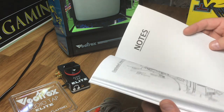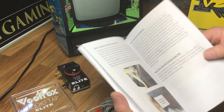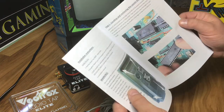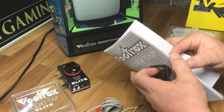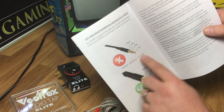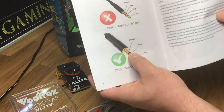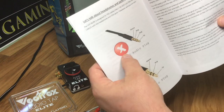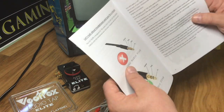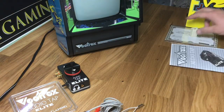This is a full-blown manual. It's got quick starts in it and everything you're going to need to know. For most people it would be all they need. Important note: when you're using cables to hook up anything, you want to use the TRS cable and not the TRRS cable that's used in cell phone connections. You want to use the old kind.